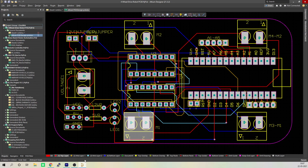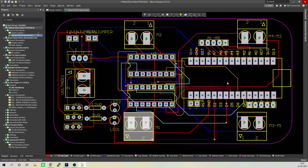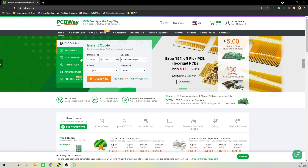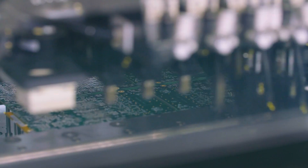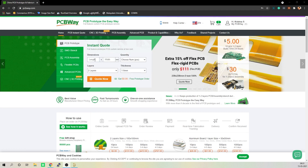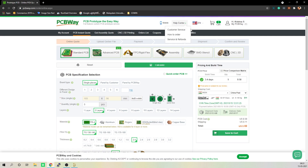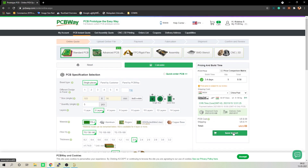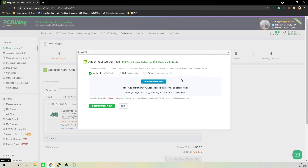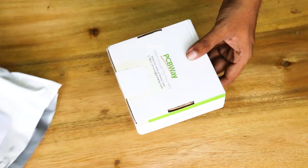This is a four-layer PCB but the components are placed only on the top side. Now all you have to do is export the Gerber file. I ordered my PCBs from PCBWay, a PCB manufacturer specializing in PCB prototyping, low volume production, and neat PCB assembly. Go to the PCBWay website, fill in the basic board details in the instant order form, provide more elaborate board details, upload the Gerber file, and submit it for review. Once the review is completed, add to cart, make the payment, and wait for the PCBs to arrive.